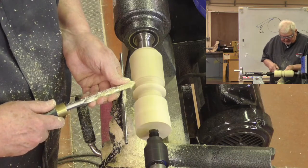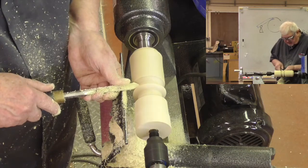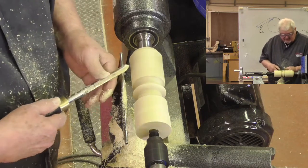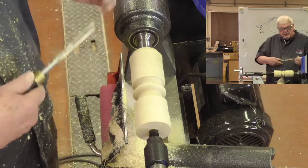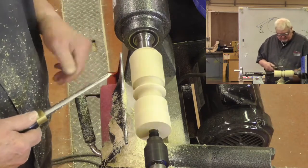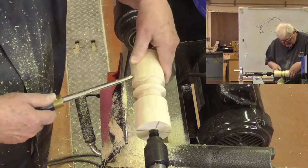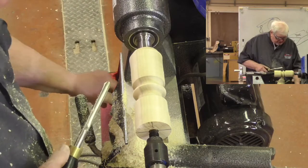Right now there's bevel behind the cutting edge and it's going to be fine. But when I didn't have that bevel behind there the edge engaged and created a spiral. That was another catch — you can see the marks from it. So catches and bevel support are directly linked.